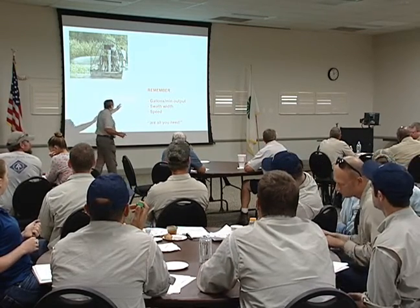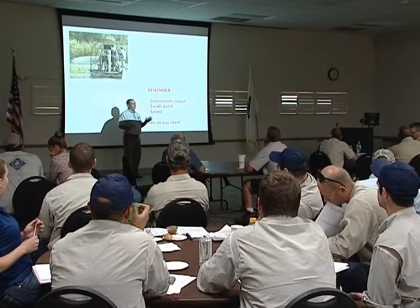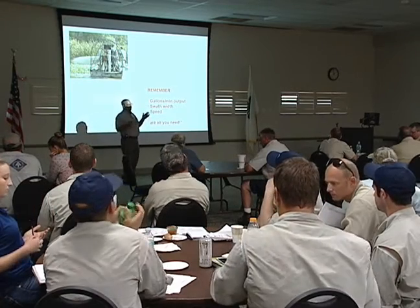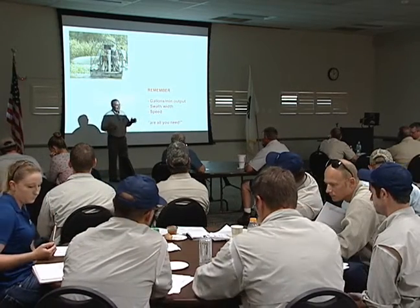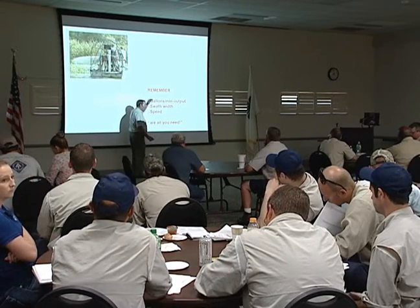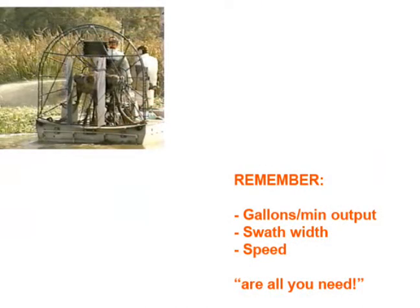All right, remember, this is all you've got to remember. All you got to have to calibrate anything. It doesn't matter if it's a train on a railroad track. It doesn't matter if it's a backpack sprayer, a truck-mounted sprayer, or a boat-mounted sprayer. You got to have three things to calibrate. Gallons per minute output. How much material are you putting out in every minute? That's number one.